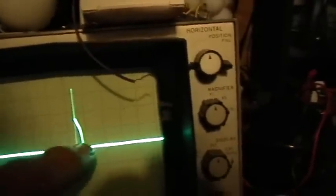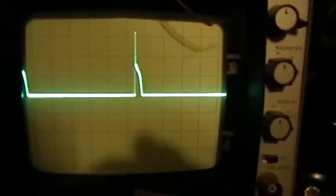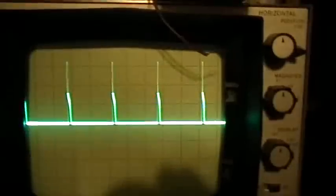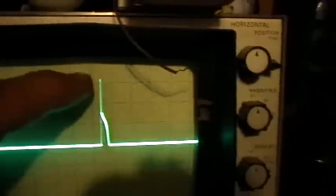You're actually seeing the neon firing, conducting a little bit, then turning off and going back down to the zero baseline. There's an oscillating output voltage. Now if I switch to ground and then AC coupling - it doesn't look like much has changed. That's because AC coupling takes the average of the signal and moves it to the baseline, and most of the average of that signal is already near the baseline.